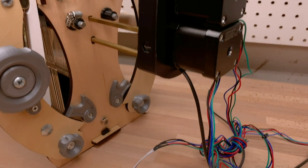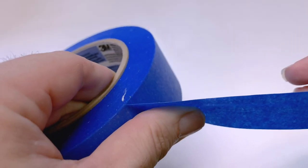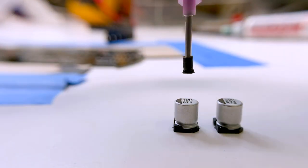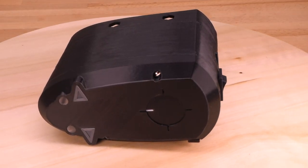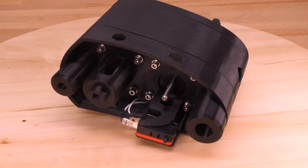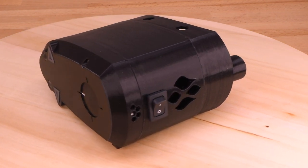The loom needed a better control system than this mass of wires and a circuit board left over from a previous project. I designed an enclosure that had a cam position indicator, arrow buttons, and some blinky LEDs. I also added some vent holes and even mounted a carriage homing switch. Finally, it was time to reassemble the loom and try and weave with it at 60 threads. Hopefully this time it wouldn't jam up or burn itself out when I turned it on.